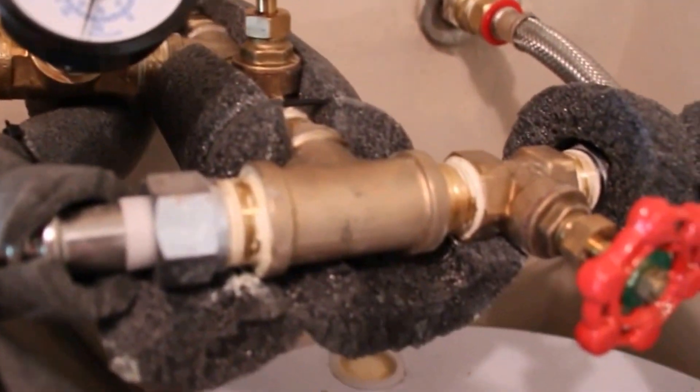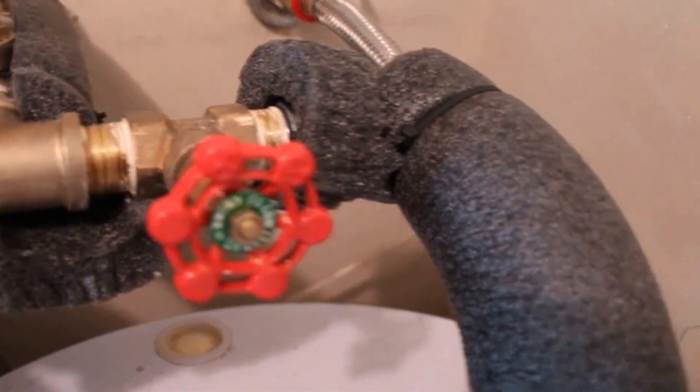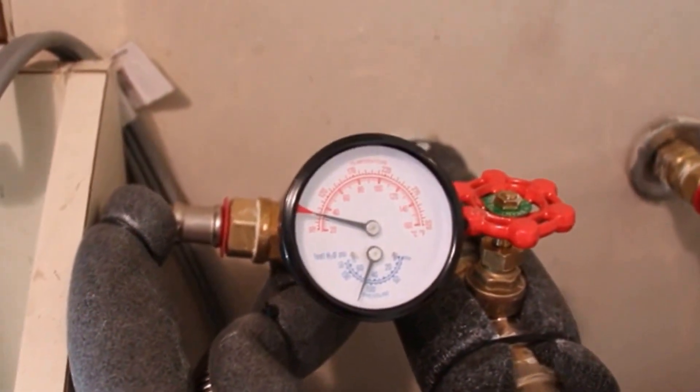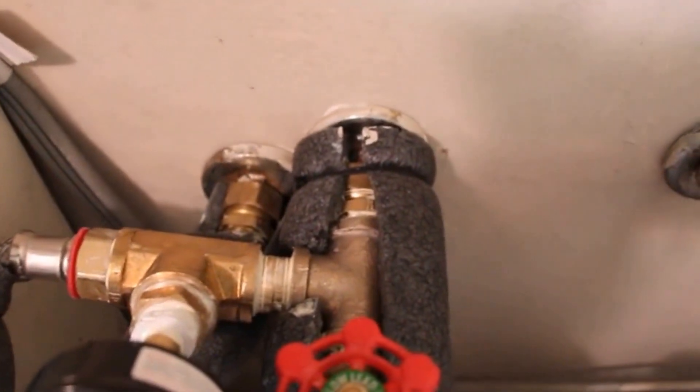Here's my 40-gallon electric hot water heater. On the left is where my copper pipe comes in — that's my warm water from my solar unit. I've got a T-split because I can go directly into the house, or I can first do a hot fill through my original water heater. There's my cold hookup, currently just hooked up with a hose bib. Here's my hot out through my water heater, and through a T I can measure my temperature after my mixing valve and also the pressures, and that goes directly into my house.